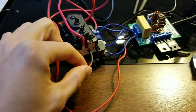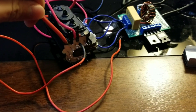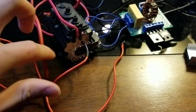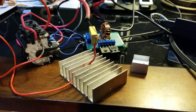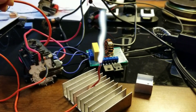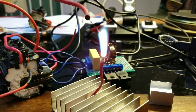Okay, I got my transformer wired up again. One thing I did not show you is that when you get your circuit running, take the high voltage wire from the top of the flyback, run it around, turn it on, and whichever wire it arcs to most, go ahead and solder a ground wire onto that and insulate it so it doesn't arc to any other pins. If your circuit is working efficiently, you should be getting arcs of a decent size — at least on 19 volts you should. You can also melt some pretty thick copper wire if you hold it there long enough.